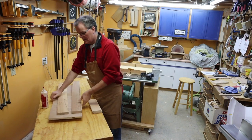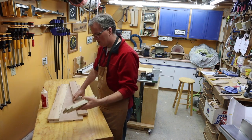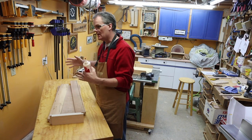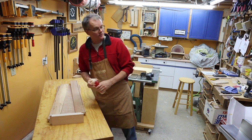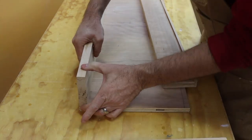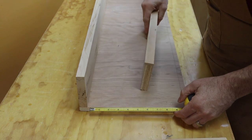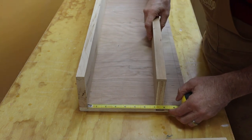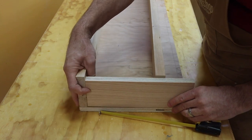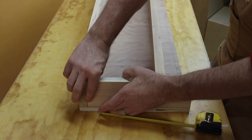I got them out of the clamps and trimmed the pieces to length — I've got the top shelf, the back, the shelf for the clamps, and two pieces for the ends. I'm going to put this together just with screws so I can take it apart again if I want to change something. I'm going to put the shelf against the top of the plywood, and I need a seven-inch gap to the clamp shelf. I want to cut a little arc on the end pieces and cut them at an angle, so I'll mark that and take it to the bandsaw.